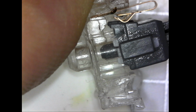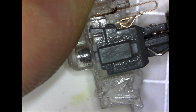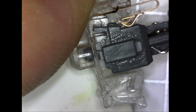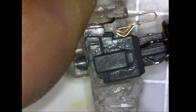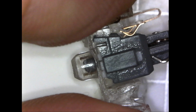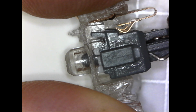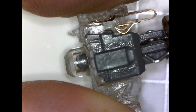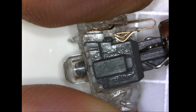See, even if the stem is pressed at an angle, before the leg has a chance to bottom out, the cushion does. You see the cushion compressing before the leg can touch. So you're gonna get pretty good silencing effect in that case. Now, you may have noticed, if you really mash your MX Zilents, if you mash them hard enough, you can still get that leg to bottom out and make a noise. But it's a lot harder because of that additional cushioning. Whereas it's pretty easy to produce that sound with the Gateron made stems.